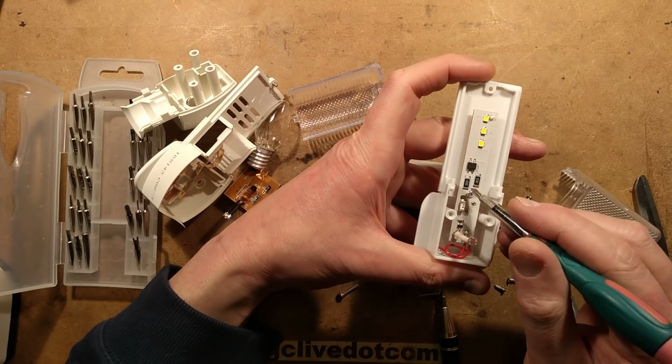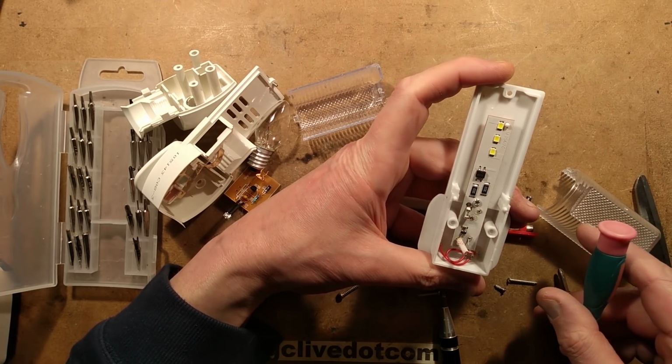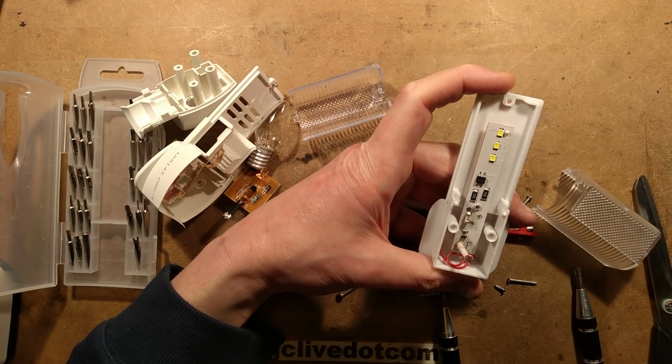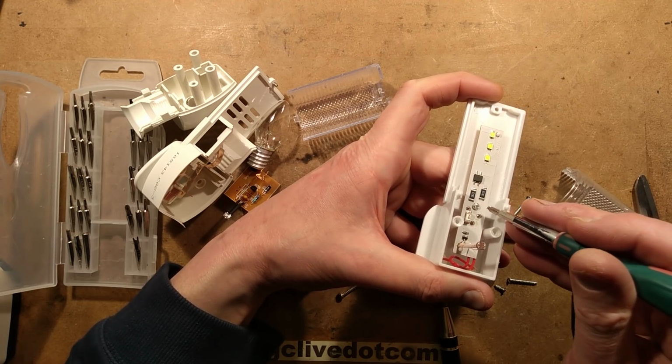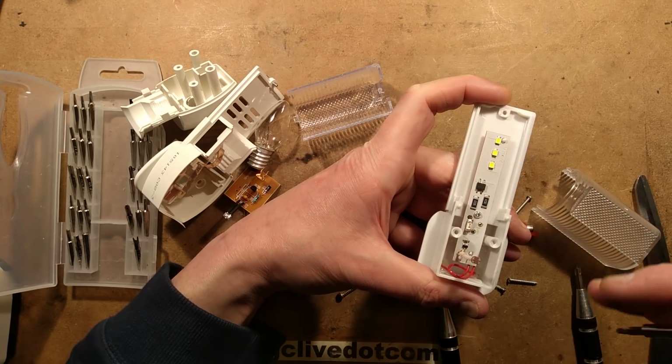It's not efficient. Most of the power is being dissipated in these resistors. That would be quite interesting to look at with a thermal imaging camera. I wonder what temperature they'll get up to. They are 30k each, 30,000 ohms each, so a total of 60,000 ohms, since they're almost certainly in series. There's one in each of the AC input leads of that.